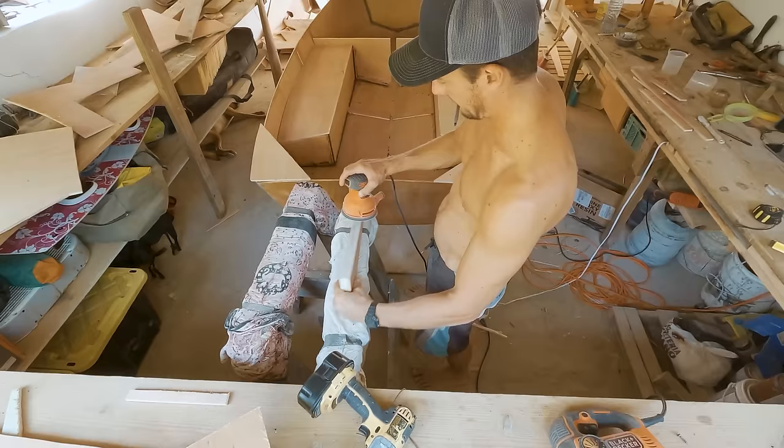I bought two wheelbarrow wheels, found a piece of rebar, and started building a launching cradle. I used a 2x4 and some planking to create the structure — there was no plan for this, I just winged it. It took me about an hour to make. I glued pieces of foam into the cradle to create padding to protect the hull. Now my boat was a lot easier to move around. The cradle works well, but it's a little heavy and does not roll very well in soft sand. I then assembled all the parts for the rudder system and tested it out for the first time — it worked perfectly, but I'll get bigger washers to hold it together in the future.